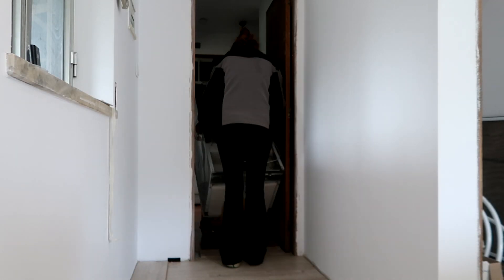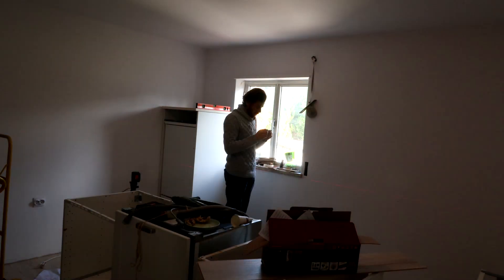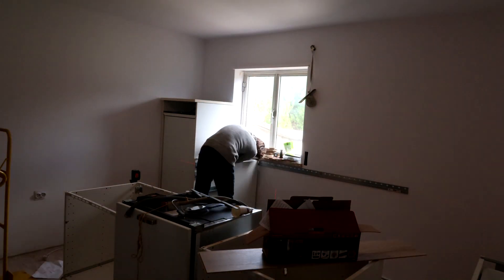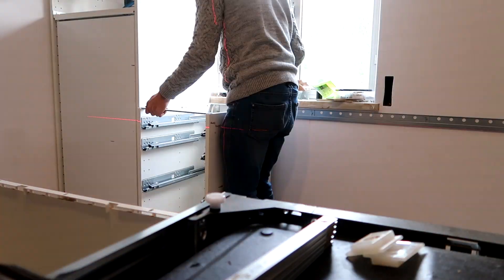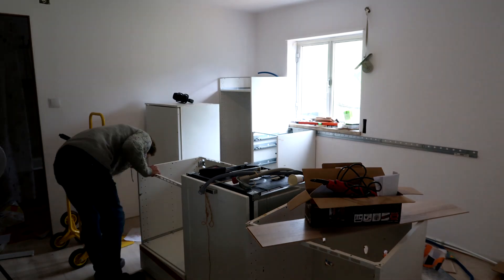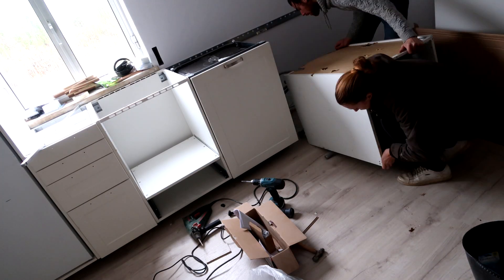Because we lowered the skirting to 8 centimeters, there wasn't much room left for the refrigerator plug to reach the socket, so I moved the fridge to its final position before continuing — you don't want to dismantle the kitchen just to plug in a fridge. After that I continued bracing the wall and installing the cupboards: first a drawer unit, then the oven cupboard, then the dishwasher, and finally the sink cupboard.